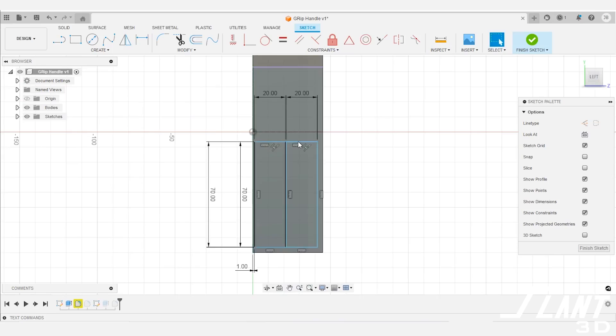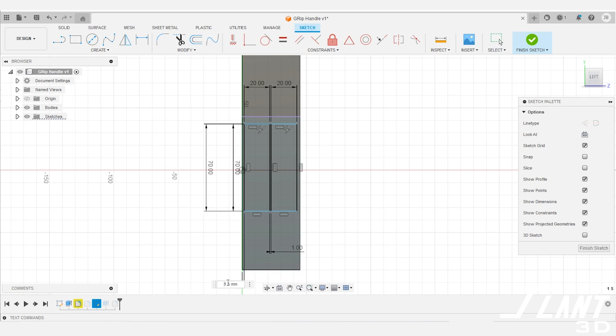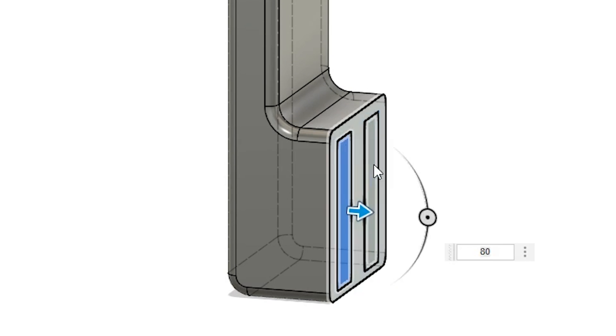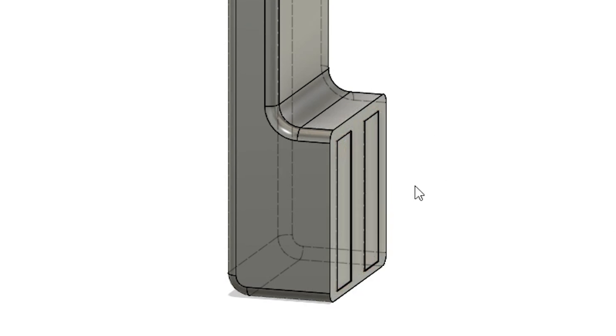To design this a little bit better, since it is mounted via command strips, we gave it a forward positioning foot right there so that they're mounted forward. The point of rotation is right there and you don't have leverage on the back that would cause them to peel up more easily — it's almost more of a direct pull rather than a twist. You can also notice that the sides are all chamfered, which allows the first layer to go down and be very symmetric with the top layer, avoiding elephant footing. We also added small indents to the back that allow the command strips to mount almost flush, and we can change the depth of those based on the depth of whatever adhesion device you're using.